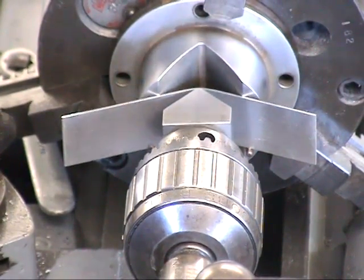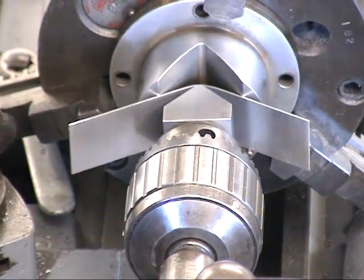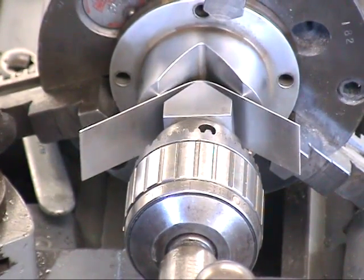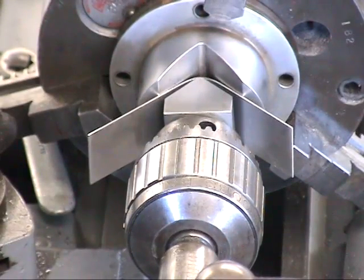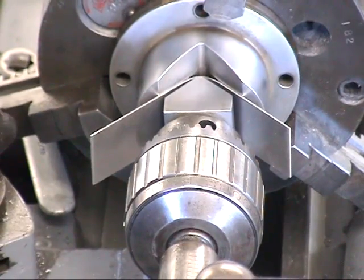The specifications call for a depth of either 3/10 of an inch or 6/10 of an inch, or 3 or 6 full revolutions of the lead screw. The key is determining the zero angle point, where the punch just touches the sheet, and then moving 3 or 6 revolutions further in.